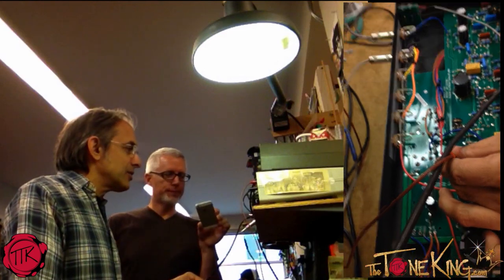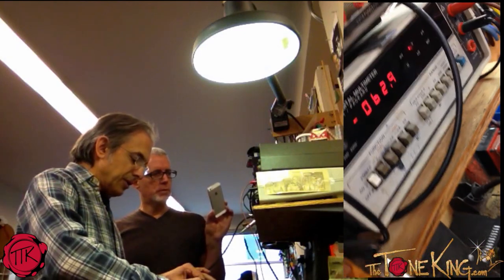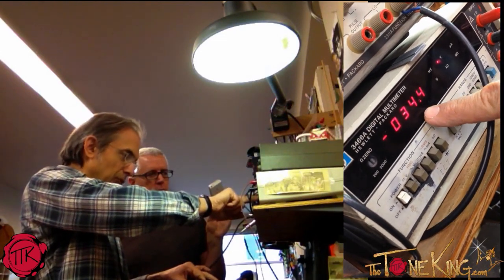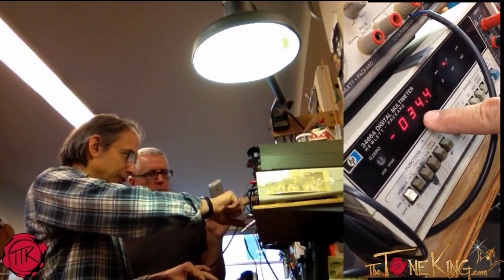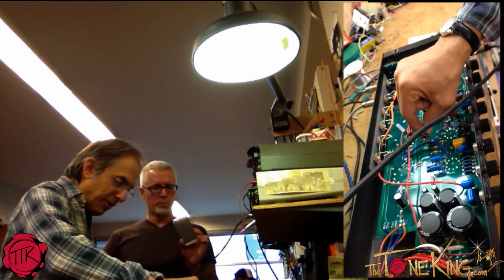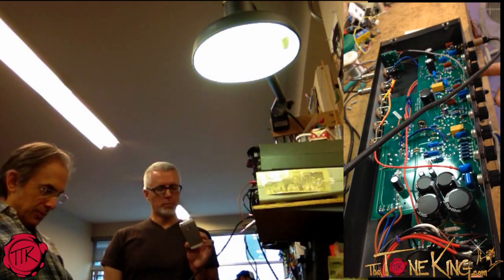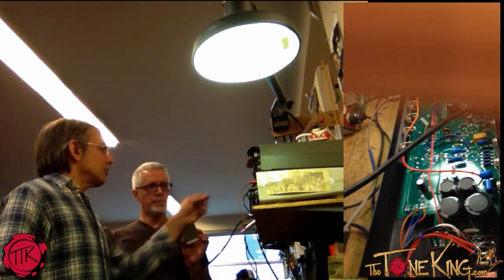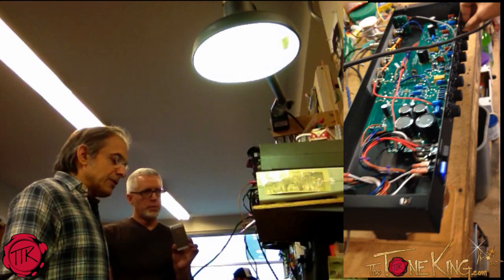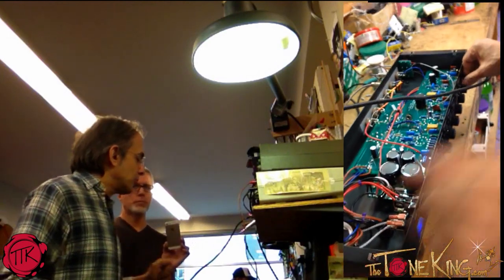So what's our bias voltage now? It's 63 volts, which is the correct voltage for a 6L6. What's our range - can we get down to what we need? Our lowest voltage here is 34 volts, which might actually bias properly for an EL34, so we might just get away with not having to change anything there. We'll only know that by firing up the amp and looking at the waveform. Why did you rotate the bias pot? Because I want to start with the voltage way too high and then bring it down, because that doesn't heat the tube as much.